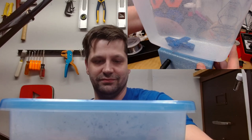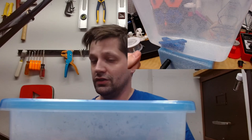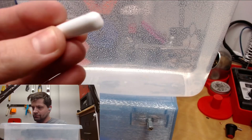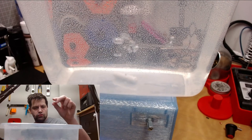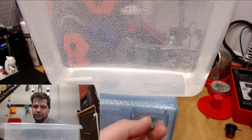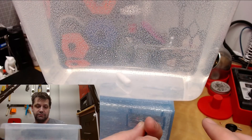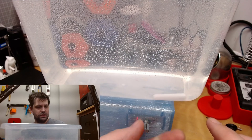Nope. Okay, that was really quick and easy — no way that one's going to work. I had this problem on the last video too: I just can't keep that stirrer in sync with the magnet. I thought it was torque that was the issue, which this motor should fix, but now I'm thinking it's speed — it's just going too fast and getting out of sync almost immediately. I need to find a way to reduce that motor speed dramatically, the easiest being to drop down the voltage using DC step-down converters. Too fast. Too fast again. Somehow also too fast.